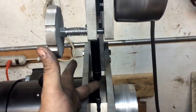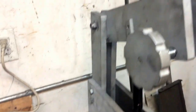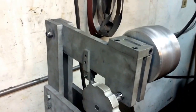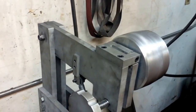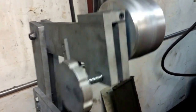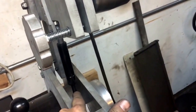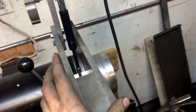With a belt on here, the spring would be providing the tension. You can see the travel of this arm — at least a good couple inches — and it probably doesn't even take that much. Even shortened up it would likely still work, but there's plenty of travel for the stroke. You just don't want to go any farther than the stroke of that spring.